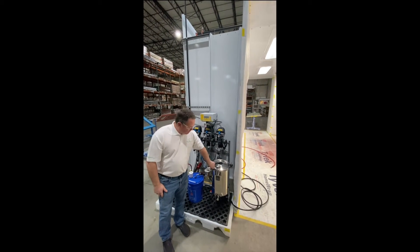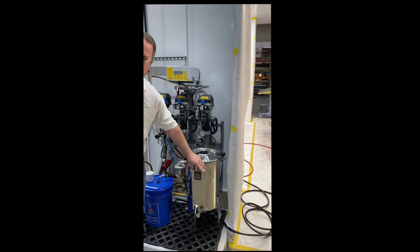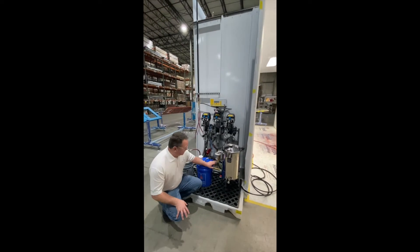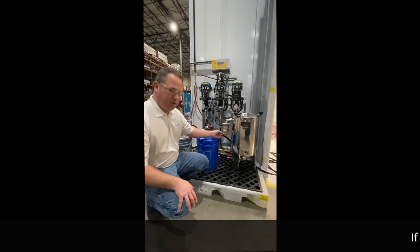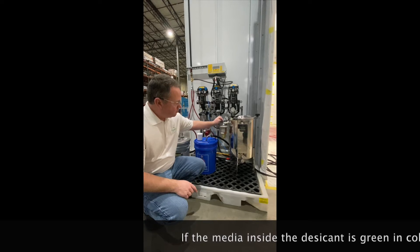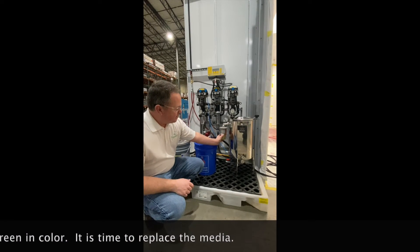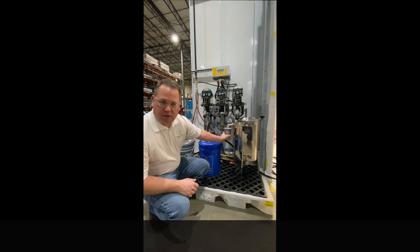This is a hermetically sealed tank with a desiccant dryer because the catalyst is moisture sensitive, so we're trying to prevent any humidity in the air from getting in and contaminating the catalyst. The air comes in, passes through oil which separates the water, goes through a desiccant dryer, and air gets back into the system. We're simply gravity feeding out of the tank and into the catalyst pump. There's a color indication — if these desiccant beads turn green, it's time to replace this filter.